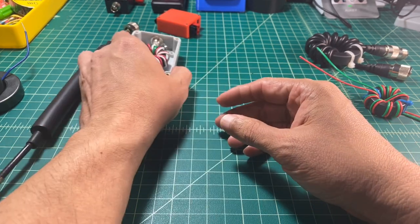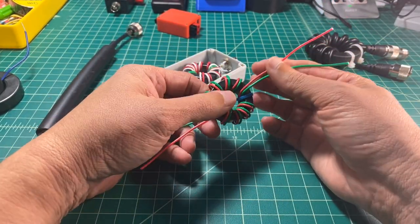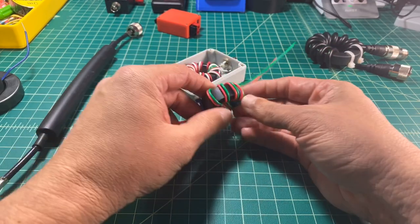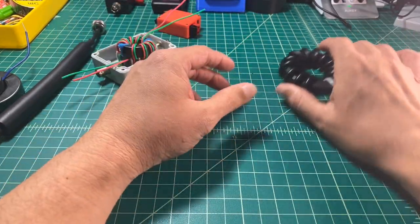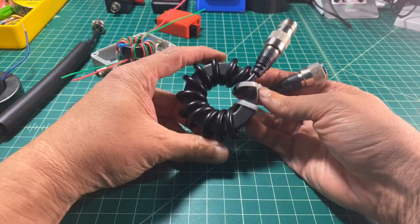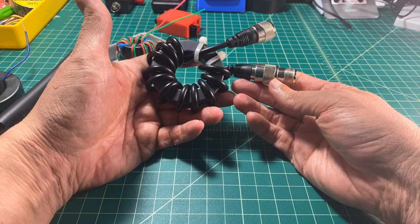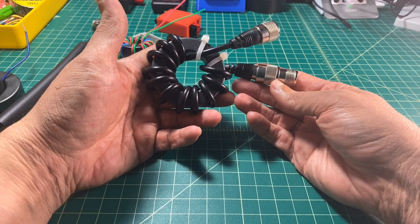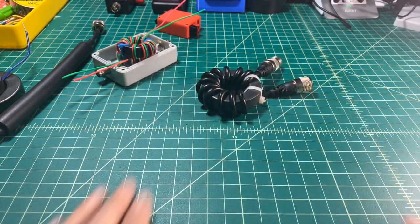We're going to be testing out the one-to-one impedance matching — we want to make sure we can keep a 50-ohm match. This is another one I wound with some Teflon-coated wire, and that wire is pretty slick stuff. And then this is a 43 mix core with 12 turns of RG8 wrapped around it. This core performs really well for me, so I want to throw it on the meter and show everybody what it does.